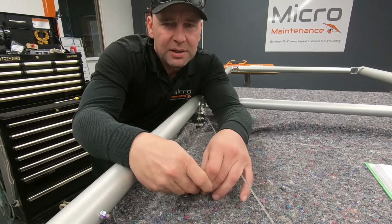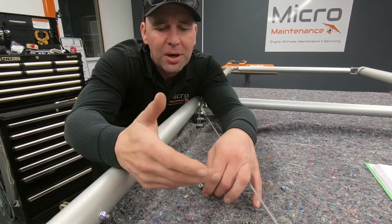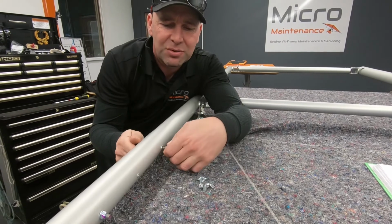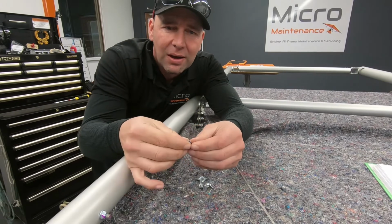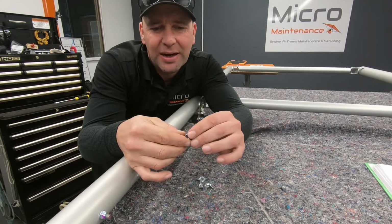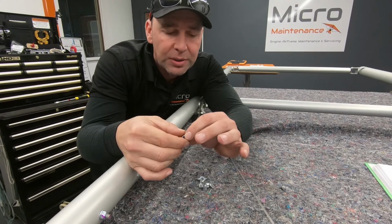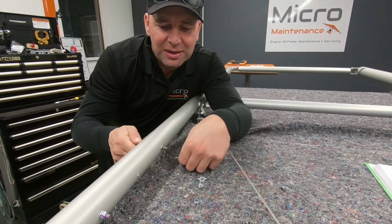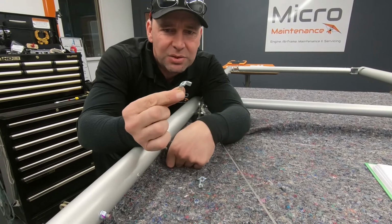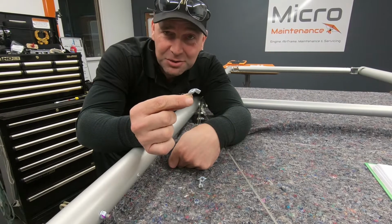Okay, so whenever I'm doing any form of mock-up and not looking at making any permanent fixings, the last thing we want to be doing is rattling through nylock nuts. I mean, don't get me wrong, they aren't the most expensive thing to buy, and I know previously I said make sure you've got them. That's for if you decide to undo a nylock. But when you're doing things like this on mock-up and you do want a little bit of tension, we tend to use wing nuts. Nicely apt, know a very good YouTube channel.